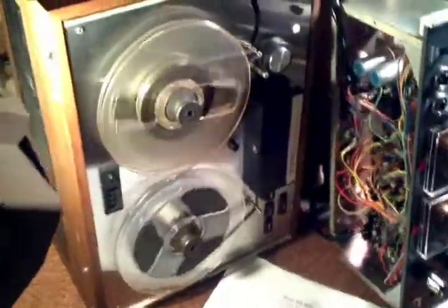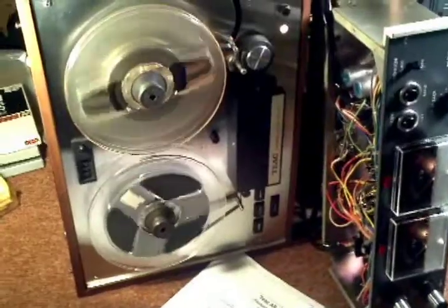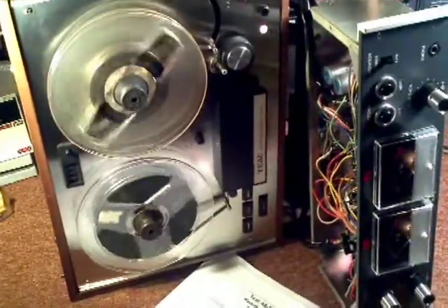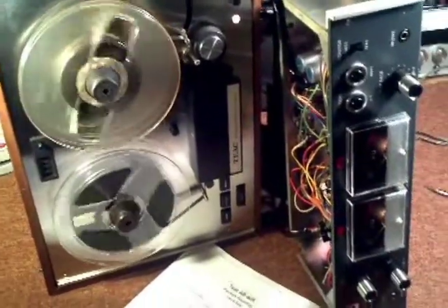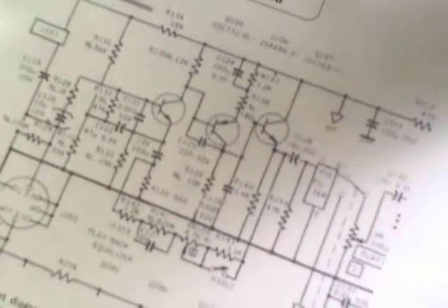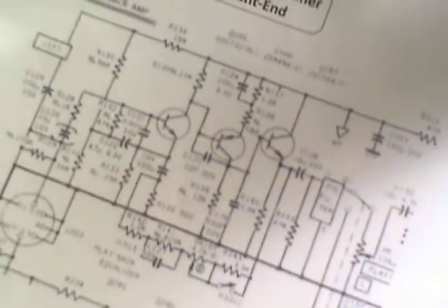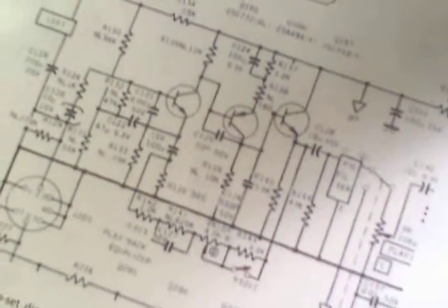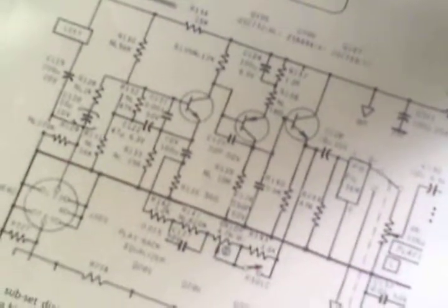Okay, I'm still exploring my low-level noise in the left playback amplifier. I wrongly assumed that the PNP was the offending device. It was not. Surprisingly, that PNP transistor cross-referenced easily to a 2N3906 standard popcorn transistor. But that did not cure the noise problem.